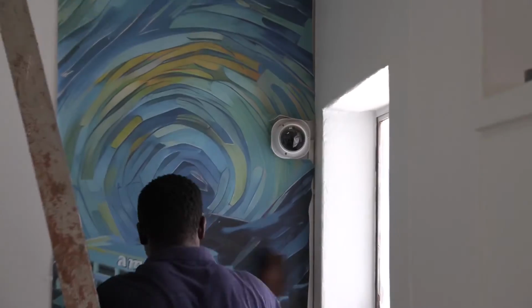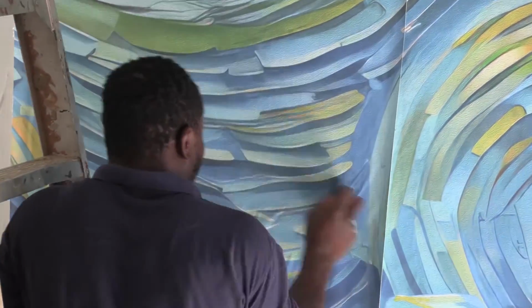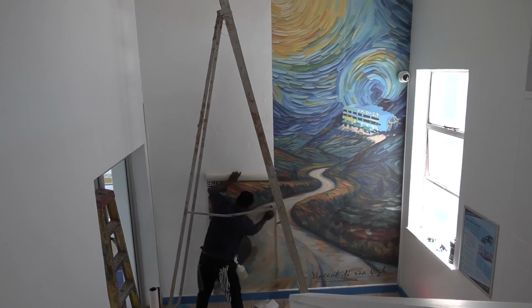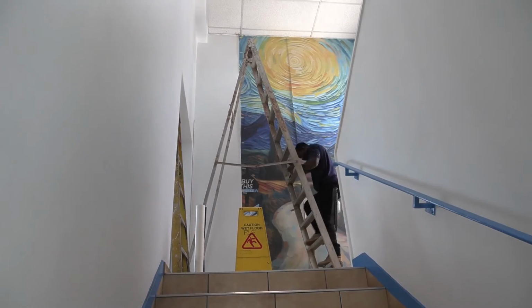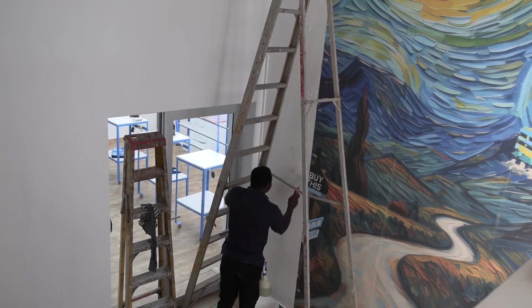So keep in mind, when you're applying your wallpaper glue, you want to keep at least a 2 to 3 mil layer of glue on the wall, and then apply some to your wallpaper on the back as well as the front, and then you just start squeegeeing once you've lined up, and it is easy as that. Once you've done the first panel, lining up your second one, we've got the 20 to 30 mil bleed that you overlap in order for you to correct if you go a little bit skew, so that you can cut off a piece so that it can line up.